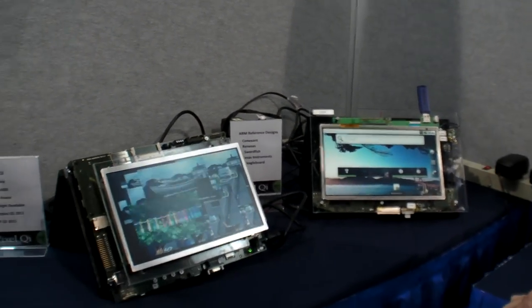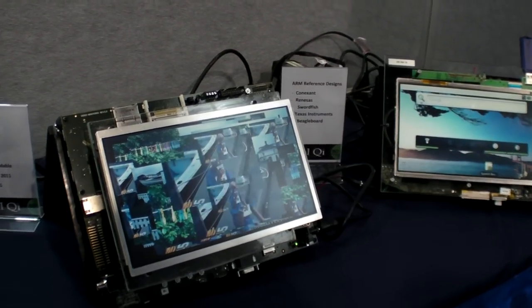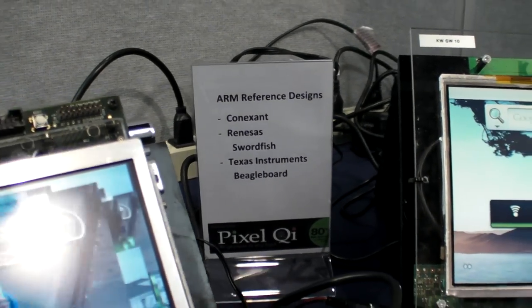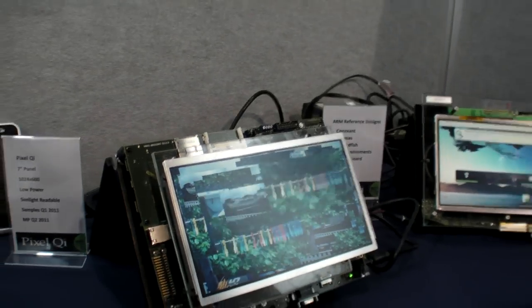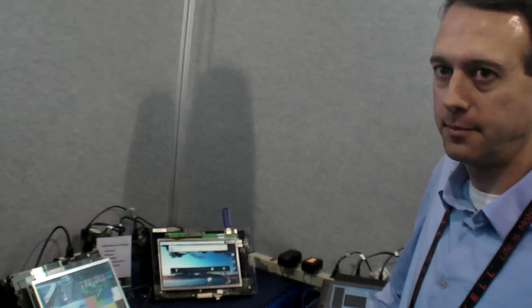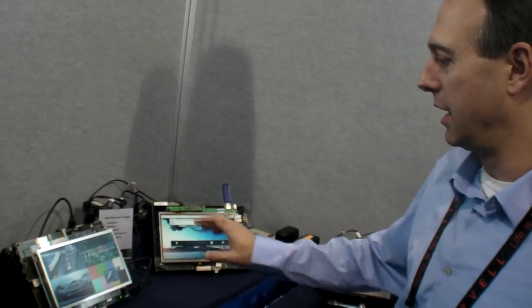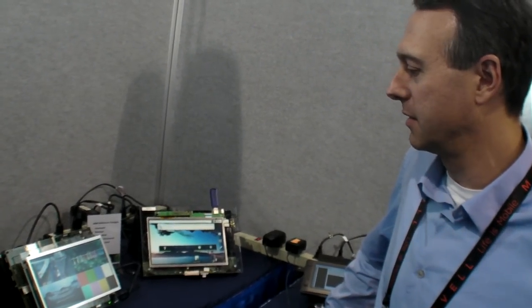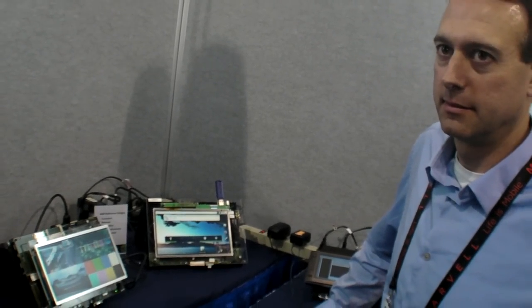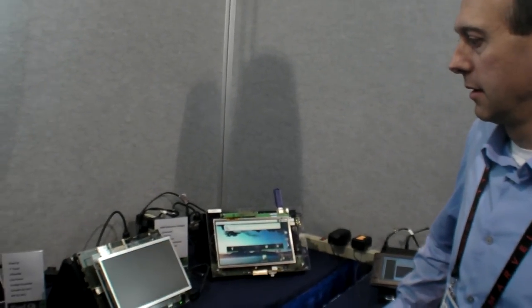What kind of things do you need to develop to use ARM with PixelQi? For the most part, it's plug and play — very much like a conventional display, with the same interface and the same drivers. But there's an opportunity for optimization in terms of customizing the software for backlight control, for power reduction, and even for image rendering. These are pretty early prototypes showing our panel working with a variety of SOCs. The SOCs don't dynamically control the backlight on these reference designs — there's no ambient light sensor — but there is a backlight control so we can turn the backlight off completely.